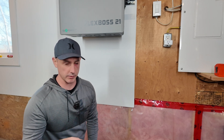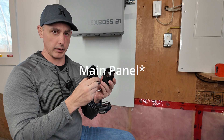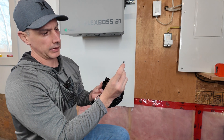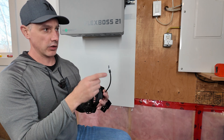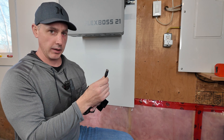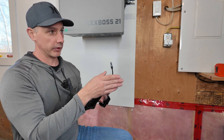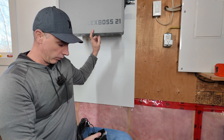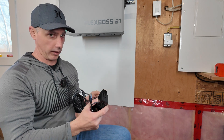I've already run some CAT7 cable for the CT sensors. The CT sensors clamp onto leg one and leg two coming into the house at the meter. I noticed the included cable is shielded — it has a metal braid on the outside — so I used CAT7 cable which has the same connector but is a larger gauge than typical cable and is double-shielded. I have 130 feet of that running over to my house, and I'll connect one end at the main panel and the other end here, giving me monitoring of house usage and enabling zero-export back-feed.